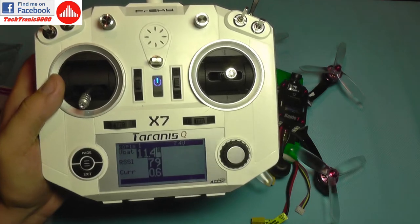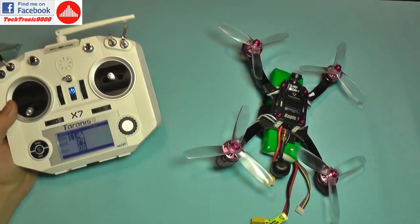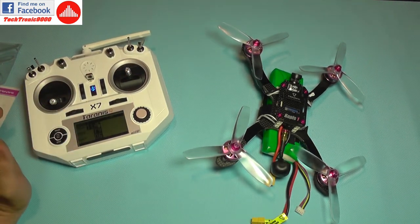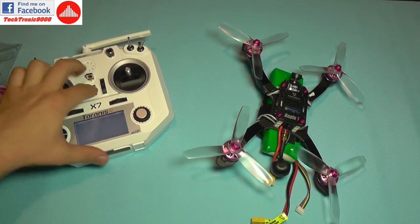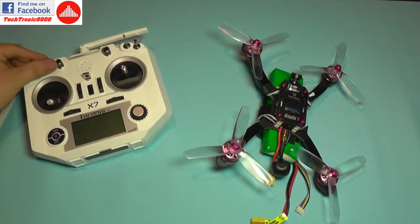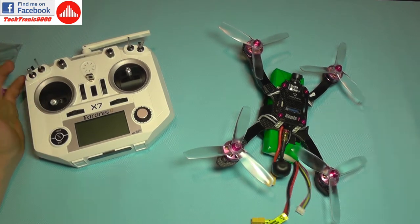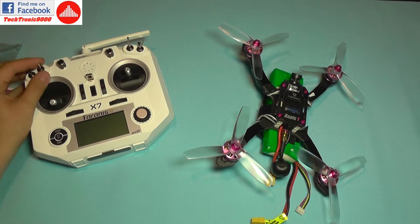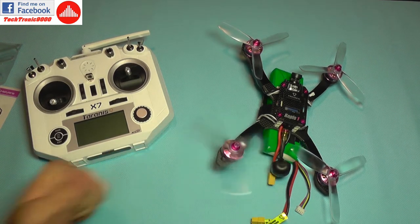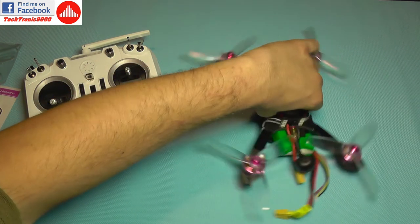The most important sensors I've selected are battery voltage, drone current, and signal strength. You are now actually ready to fly. I've set up three flight modes: Angle, Horizon, and of course Acro mode. I'm going to test this quadcopter soon and take it out for a flight.